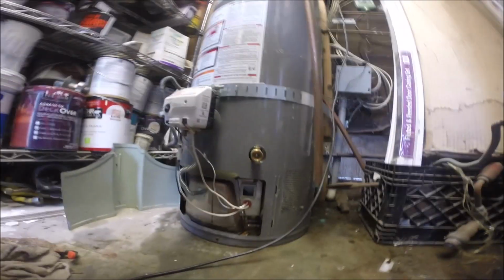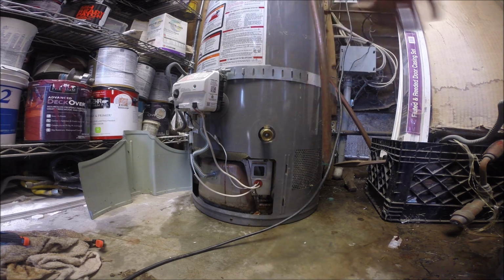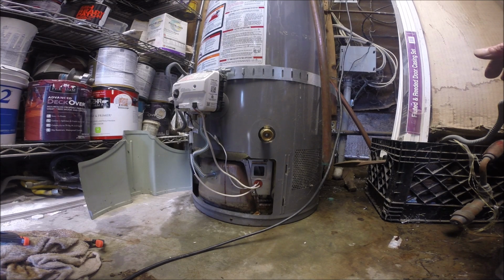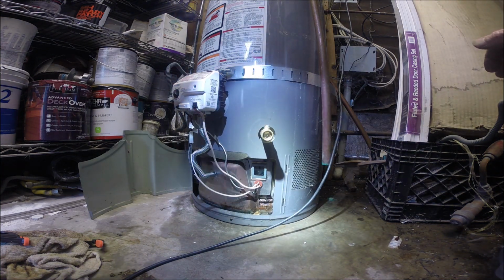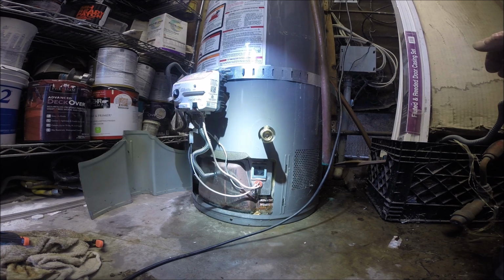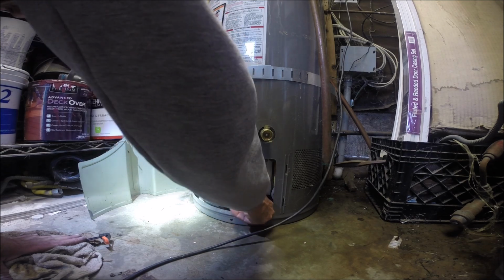So yeah, that's kind of my standard procedure with these Rheems. I was just watching a video from Pershing Plumbing, where he went out and replaced a Rheem that was leaking. I was trying to tell him, it's usually the drain valve. It's not always the drain valve, but they're notorious for leaking. And I'm trying to see if any more water is going to show up here. And you just get the water out of it.